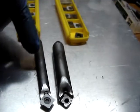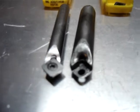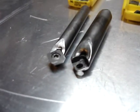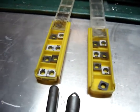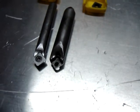So I made two here — 3/8 shank and half-inch shank. You can see on the half-inch one without the insert the way that I did it. I just used a quarter-inch end mill to rough it out, and then an eighth-inch end mill to finish it, and let the CAM software do all the work. Because I bought this lot of square inserts on eBay for — I don't even remember, but it was ridiculously cheap — and I needed to find a use for them.